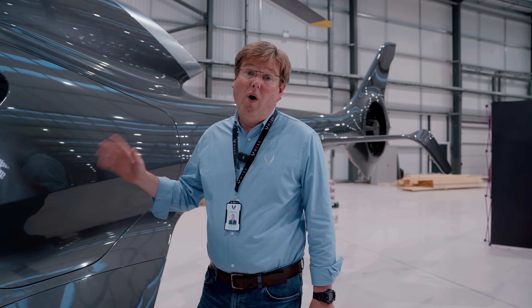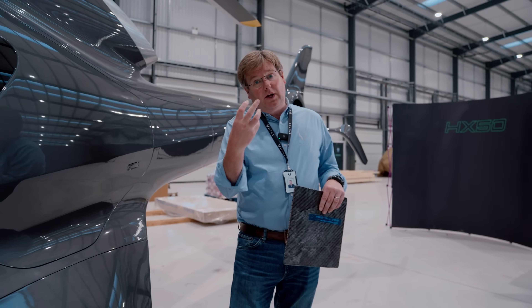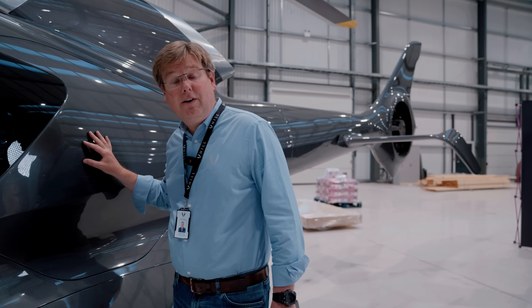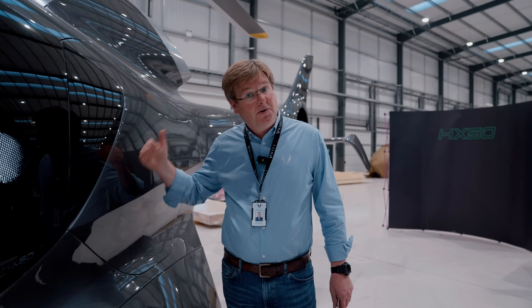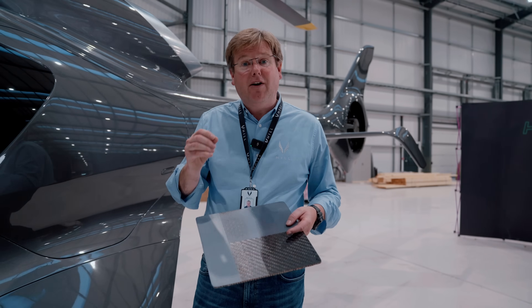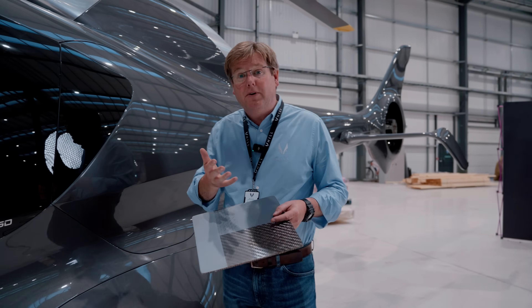Lightweight high performance composite panels are actually quite difficult to paint well. These very thin laminates with strongly woven fabrics, lightning protection, and thin layers of honeycomb core create all kinds of witness marks on the surface that you then have to try and build up and smooth out with layers of high build primer. That process doesn't work from a production or weight point of view for an aircraft. One of the techniques we've been experimenting with is the use of a film-based primer — an epoxy-based primer laid on in the form of a film onto an ultra-thin layer of chopped strand glass. That scrim layer allows us to essentially disguise and fill out the lightning stripe protection and any witness marks from the honeycomb coming through the carbon.